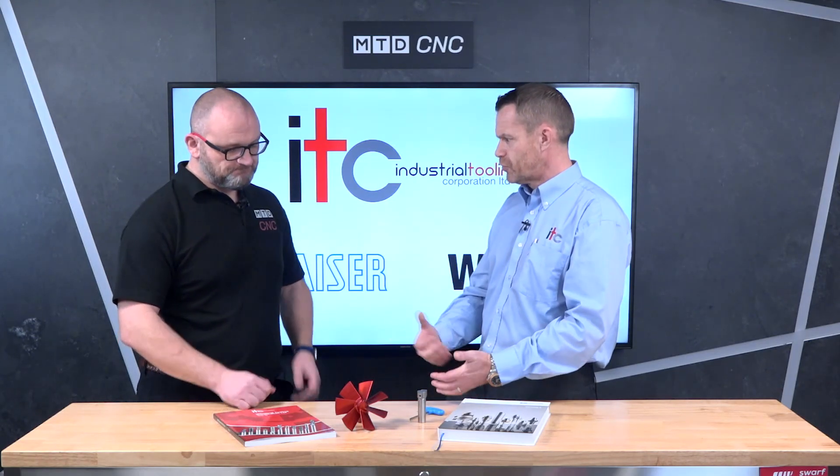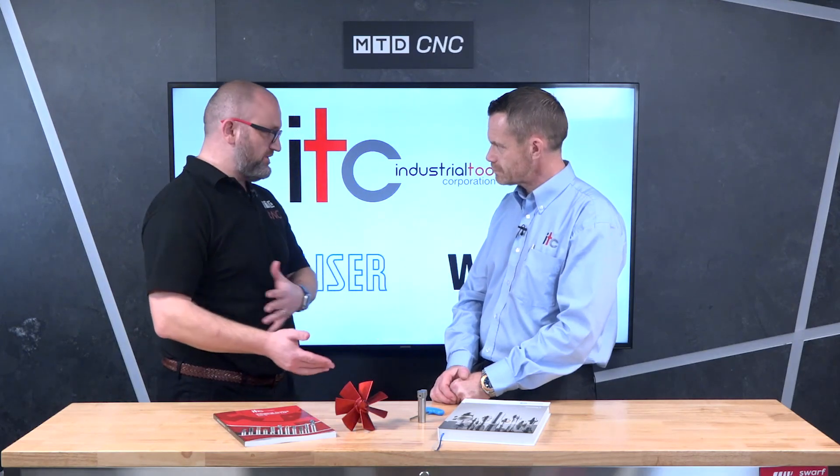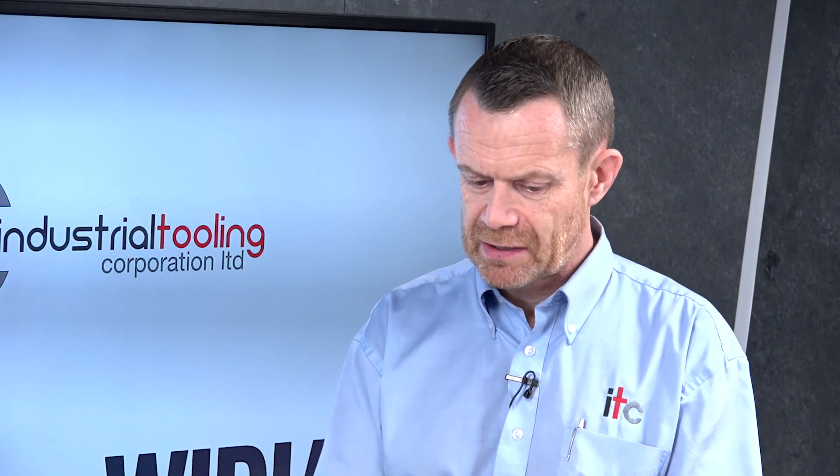As people move into more productionized environments, they want to cut down manual intervention — somebody leaning through the door with an air hose is not a great idea. There are a number of advantages: keeping the machining environment clean between rough and finishing stages, avoiding recutting swarf in deep pockets. But the big one is automation — components can be quite wet, and if you move the part, there's going to be a puddle on the floor. This removes certainly 90–95% of the coolant, making it ideal for automated environments. Coolant itself is quite expensive nowadays, so keeping it in the machine is great, and it supports robot part changing in a production environment.